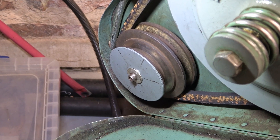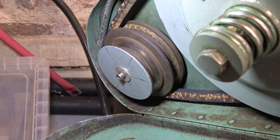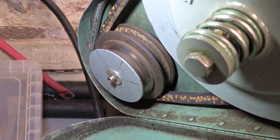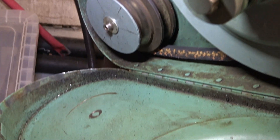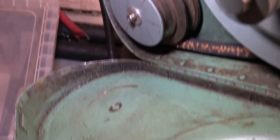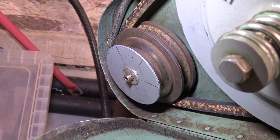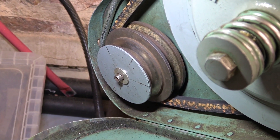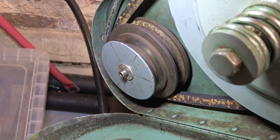Time to get that pulley off. I made a kind of top hat for it — the thing was so loose when I got the shaper, it was wiggling off all the time, and you can see those witness marks in the case. I did use Loctite on it, but it was the removable Loctite — hopefully. I may have to heat it up.